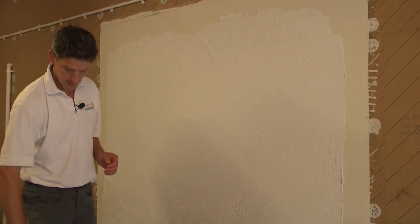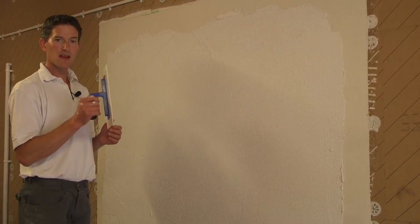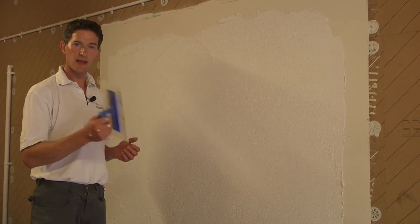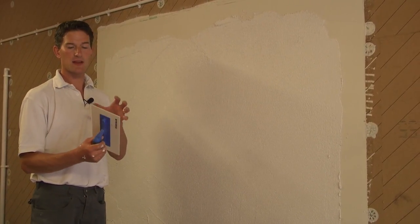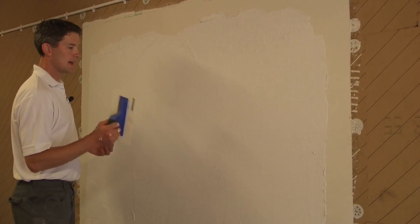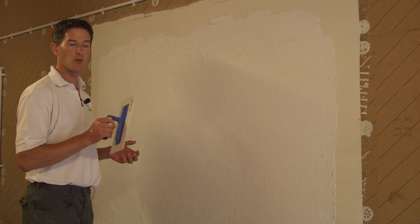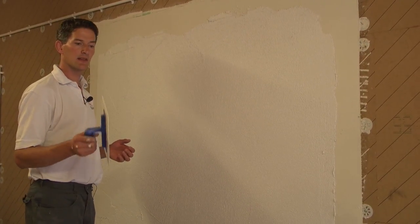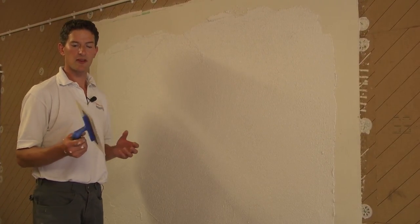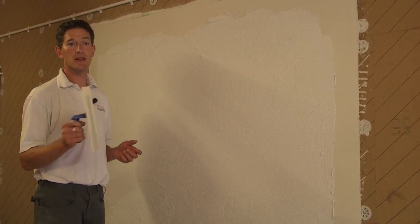What we do then is simply clean it first and then rub it over the surface. Every 15 to 20 seconds, take the trowel off and scrape the render off that builds up on the trowel — that will give you a much better finish. Ideally one person puts the render on and one person finishes it, because each person has their own pattern that will form on the wall. It's important to get a uniform pattern, so try not to switch people rubbing it up.